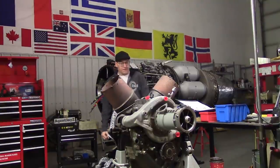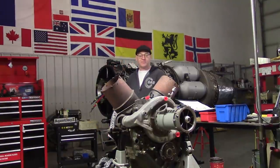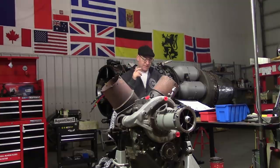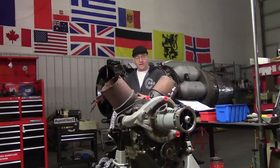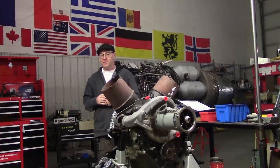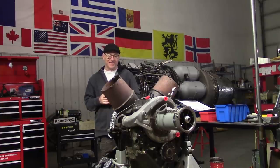Hey everybody, it's the weekend and it's time for the next installment of the mini jet boat project. We are slowly bringing back to life a tired, beaten-on Allison 250 C18. I've checked with the owner and the head honcho of the project — we are going to remove a compressor half so that we can clean the compressor and take a look for any FOD damage. Hopefully we won't find any, and if we do, we might just do nothing about it — this is a limited budget.